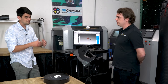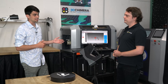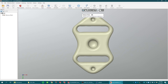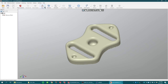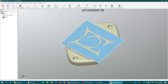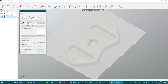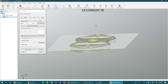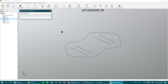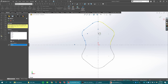While it seemed pretty easy to collect the 3D model data, translating it from this point cloud or STL file into a usable model in Fusion or SOLIDWORKS seems like it's the hard step. There's one additional step in the STL cleanup as well as the reverse engineering to collect the data we really need. Even if you bought the fancy 3D scanner, there is still some engineering needed behind the scenes. We can use the scan data to create a fully watertight mesh, but our end goal is a fully editable CAD file. Because the part is fairly simple and symmetric in X, Y, and Z, really all we need is a 2D sketch. I'll open up the 3D scan data in our software called QuickSurface — a nice reverse engineering tool that allows me to quickly pull off any relevant features as well as 2D slices. That's our surface that is going to be clamped in our soft jaws, and here we've imported the sketch into SOLIDWORKS where we can make the cut.